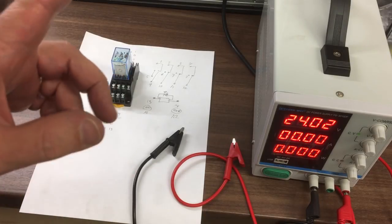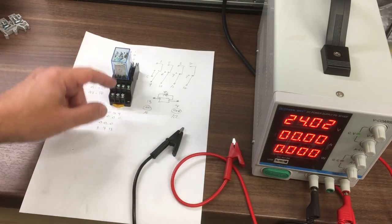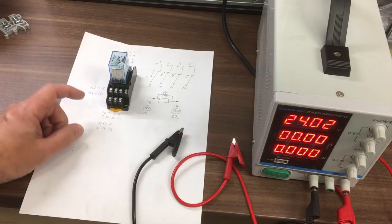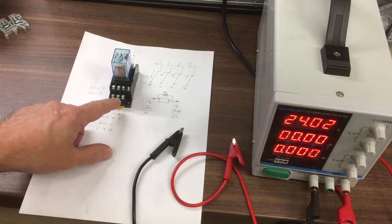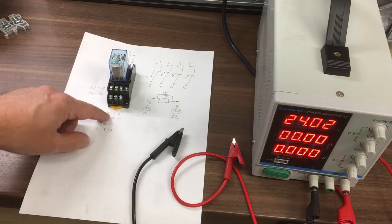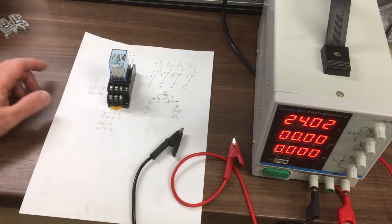Hang on a minute. I was just about to wire up the reset switch to the relay, one like this that's in the unit. It's a DIN rail mounted relay, and like all these relays, you need to wire up pins 13 and 14 to power. So I've just got my little crib sheet down here because it's quite hard to read all those. I've got each pin labelled out down here.